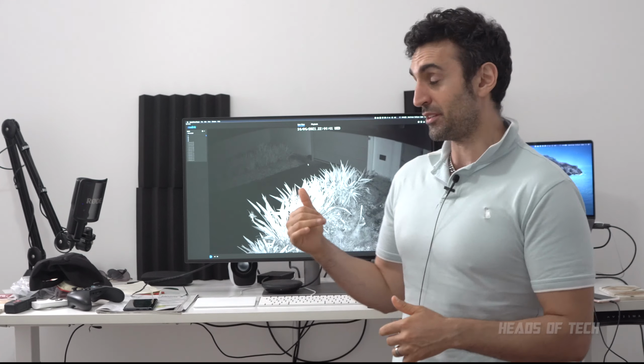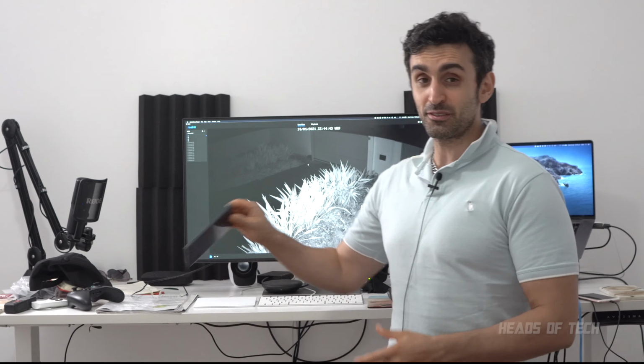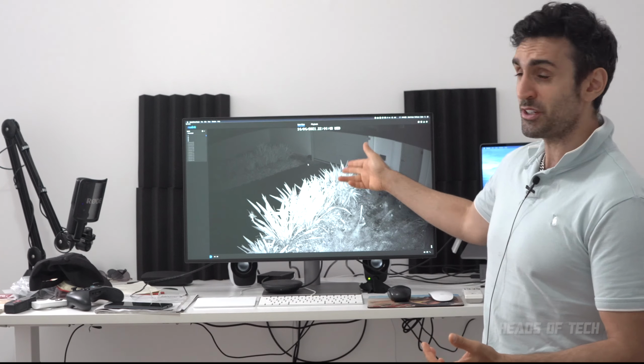That's lucky. All right, so we got it set up on the Mac directly, but of course, instead of plugging the Ethernet into the Mac, you can plug it into, for example, your Wi-Fi router. What that allows you to do is actually use the app from anywhere in the world through the net, or at least your local network. The way I've set up at the moment, I've got it plugged into my Wi-Fi router, and that means any computer on my Wi-Fi can access the NVR, and there's an app on your smartphone, so you can just jump straight in. You can play back at up to 16x recording speed. You can even do it on the new version of their app.